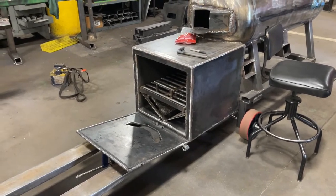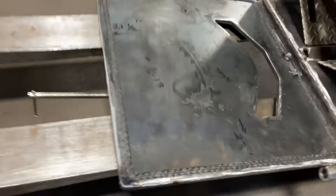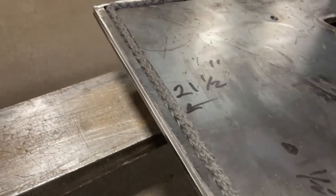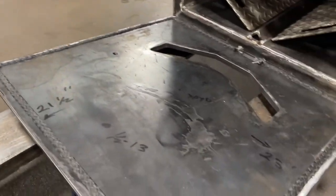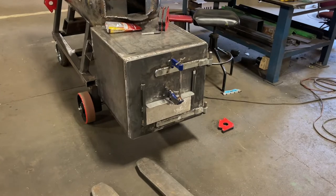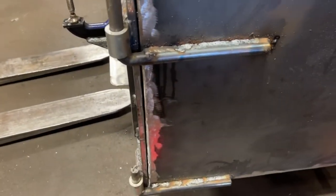Now that the C-clamp air damper is all installed, I'm ready to mount this thing to the firebox — a bit worried and nervous about this part. First thing I did in that slot we milled in there: I put in some fireproof wood-burning stove insulating rope, that should seal this up real nice. And once — well, it's about two inches short. Story of my life. We have a door — look at that, that didn't go on as hard as I thought it would. Actually went pretty easy. I just welded the bent three-quarter-inch rod to the sides and it opens nice and smooth.